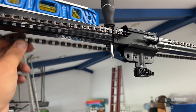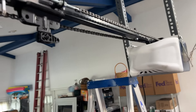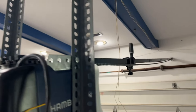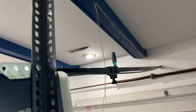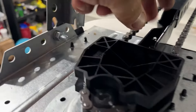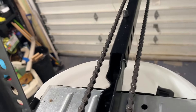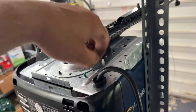We secure the bolts and tighten the garage motor — everything looks great at the right height. The brackets are long enough. Next step: make sure the chain is tight, tighten on the other side, and check the manual. Double-check that these two bolts are tight — also one here and one there. The chain guiding plastic piece is also secured — we're all mounted and I'm happy.